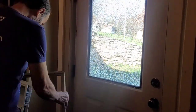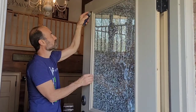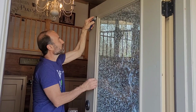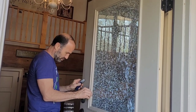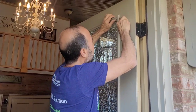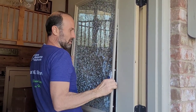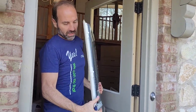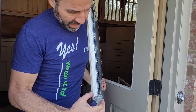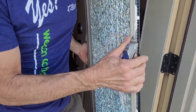So this outside glass should be caulked into the door so it shouldn't fall out. That's the first step — now we're going to go to the outside and cut that out. We're going to do the same thing out here: cut this caulk. There are no screws on the outside because the screws come through from the inside. We're going to cut that caulk loose and then pull the glass pack out. You can see the thermal glass pack there, the outside frame that's fixed to the glass, and the inside frame we took off before — so it's the same process for putting the new one in.